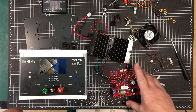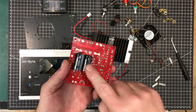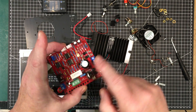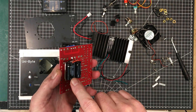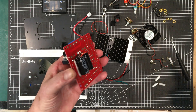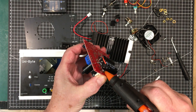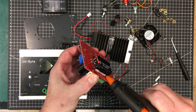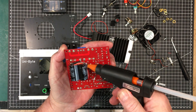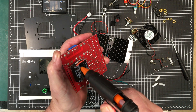We made some very small changes in the meantime. I put on an extra capacitor here, so we've got a total of 9,900 microfarads. I'm using the nice Nichicon capacitors for this. I just need to put a little bit of hot glue on them to stabilize them. They probably don't need it because that sponge tape is pretty good, but I'm going to put some hot snot on there.